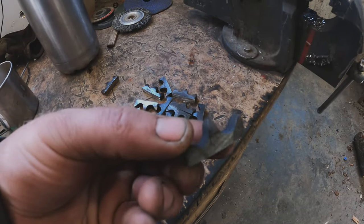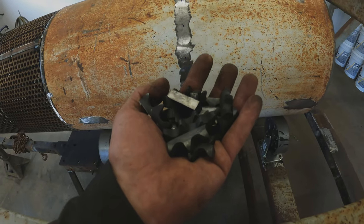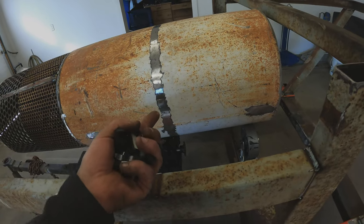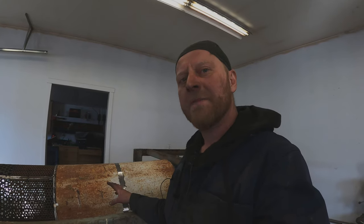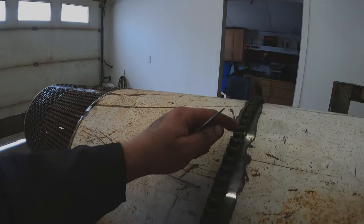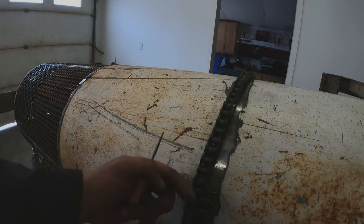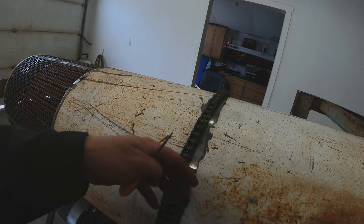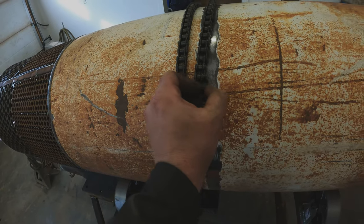For the barrel sprocket, I'll show you a cheap method. This is cut up from a bunch of smaller sprockets that we'll weld on. All these pieces cut from a 15-tooth sprocket cost me about $30, compared to getting one plasma cut which would cost about $600. But going cheap usually means there are troubles behind it — these can be super finicky. What happens if you just start laying these links out and tacking them on is by the time your chain rolls around from the drive on the radicon to this point, it'll actually misalign and the chain will either not rest on there or jump off.